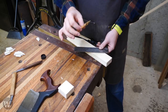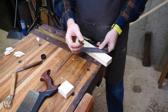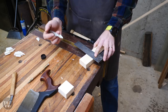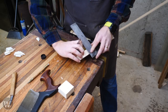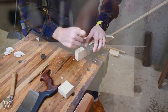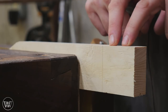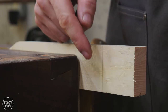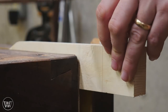Now a second-class cut is where you take the pencil and throw it out the window, because a pencil is really not an accurate way to make a mark — you have the thickness of the lead line to deal with. What I want to do is grab a marking knife and do basically the exact same thing, but put the marking knife line on here. With the marking knife, what I'm actually doing is cutting the fibers. I have a marking line, and I want to keep this piece — the other piece is scrap. So I'm going to stay on this side of the line and cut down, and that cut is going to make it so that the blowout from the fibers doesn't happen on this side of the line.